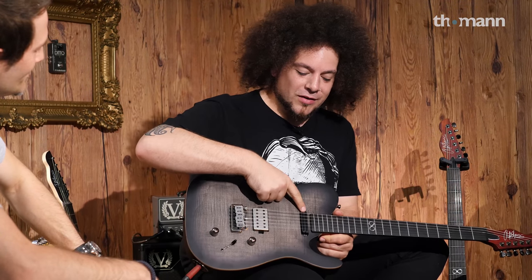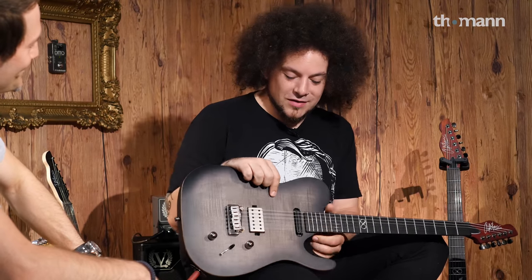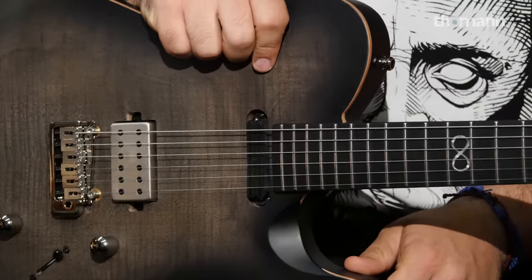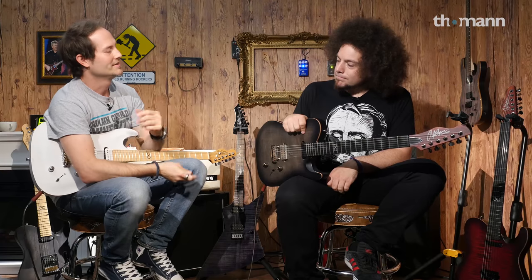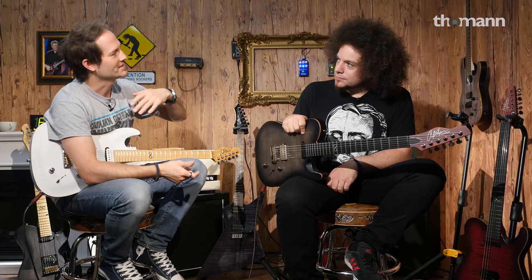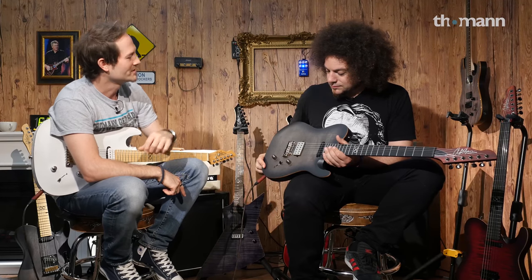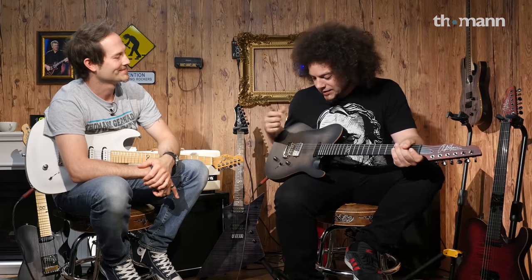And then going for a single-coil-sized humbucker style pickup, which I think visually looks very cool, and has its own unique sound as well. Because the two coils are so close together, you don't have that much phase cancellation going on, as opposed to a real humbucker, where you have something like 1.5 centimeters between them. That's a unique sound. It's made a big difference.